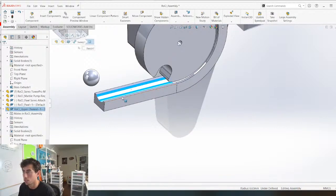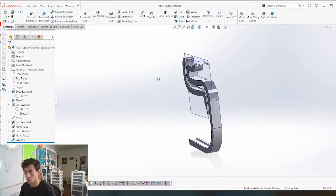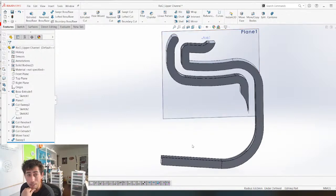So let me just show. I'm going to create a path just to see. Yeah, it's going to be turning with. It's going to be ratcheting because I wanted to be able to control it easily without feedback. If we don't have to put a feedback switch to say that there's a marble there, that's why I want to use a servo that's ratcheted, because every time it ratchets down and goes back up, it's going to be producing another marble. A Geneva mechanism would be cool, but in this case there would have to be some sort of feedback loop telling you that once a marble comes up here and is fed up to here, it needs to stop turning. Unless there's a better way to do it, but for now I'm just going to go with this and then we can figure that out down the road.